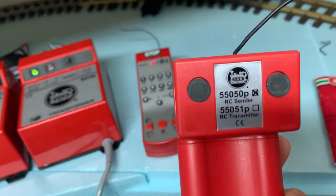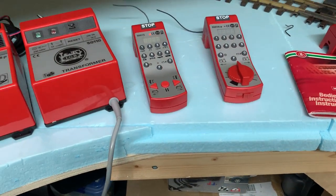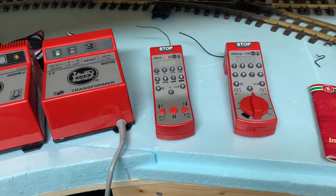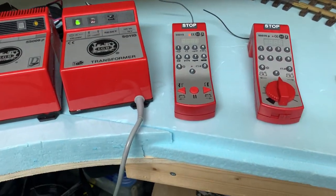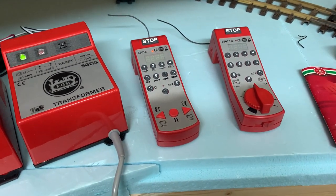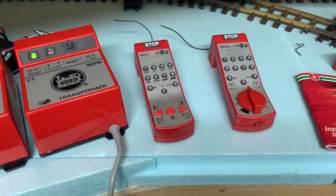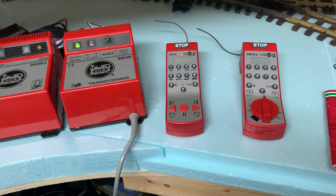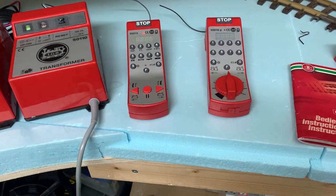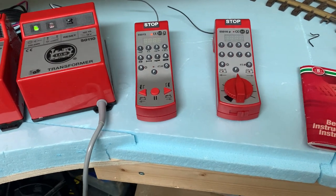This sender unit has a P, and P is for parallel. When I was looking around on the internet there are all sorts of old wives' tales about this stuff. Basically everything is compatible with everything else. It's just that with the serial version, if you send a CV command - say CV23 - with the non-parallel version it'll send the number one 23 times, so there's potentially a significant time delay.